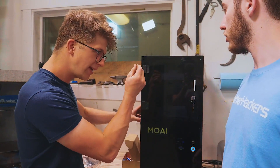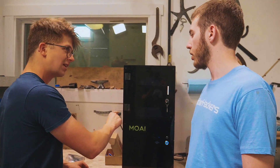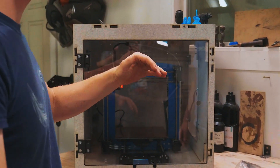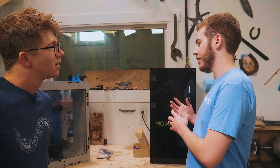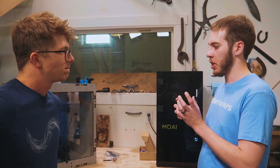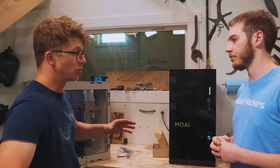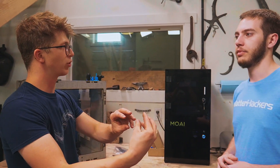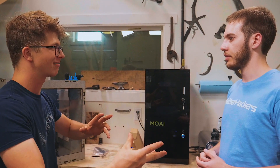This one with that tiny laser is super precise and super accurate, but it only prints in resin. This one here is less accurate, a little bit faster, and because it is melting plastic with thermoplastics, they're plentiful - there's a lot of different kinds you can use. With resin, they're a bit more specific: you basically have solid, a little bit flexible, and some specialty ones for casting specifically. So here you could get a higher or lesser strength material to print with, whereas here you're kind of limited to resin or casting resin.